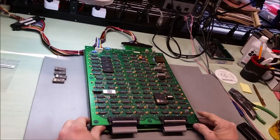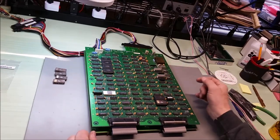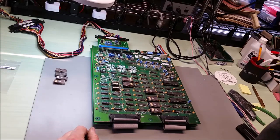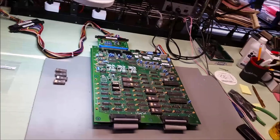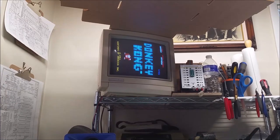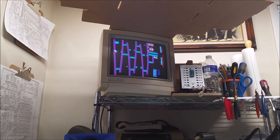So we had the coil missing, the EEPROMs - that was it. Wow, that's a great fix. Very simple. Well, it wasn't so simple - thank goodness we had a spare board that actually had one of those coils on it, and it was a parts board at that. All I need to do now is give it a bath, clean it up, put it back together, and it's ready to go back.